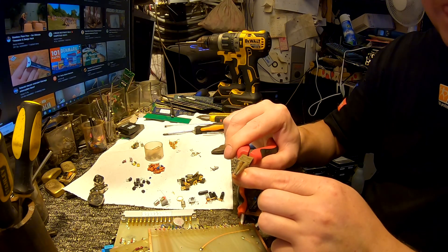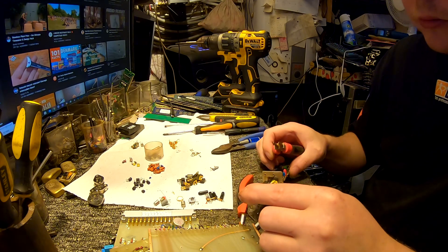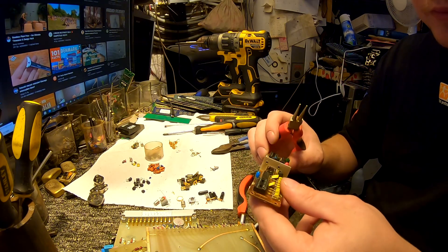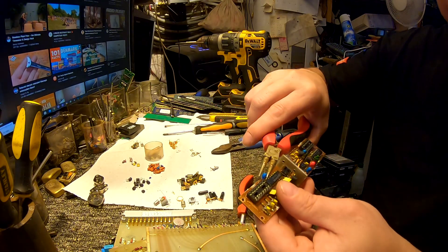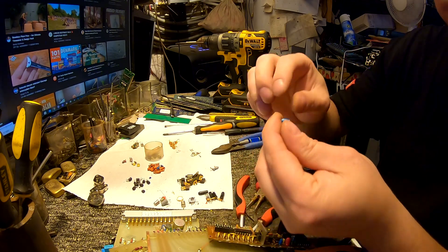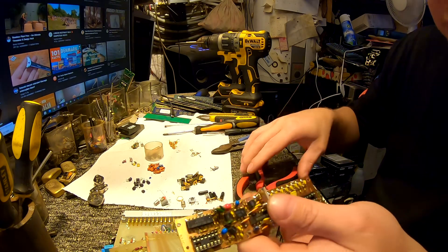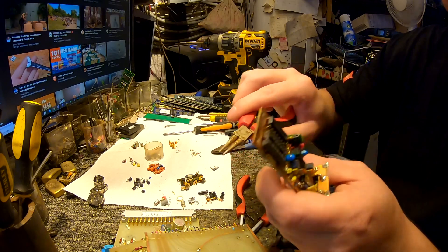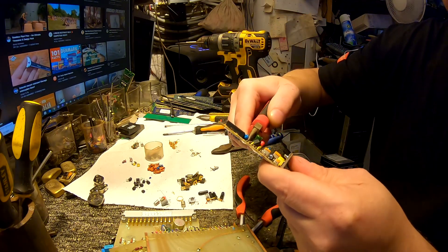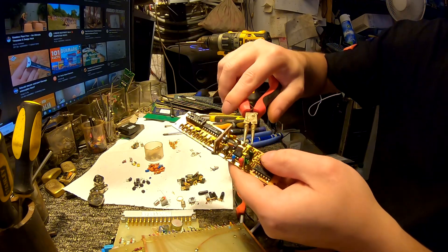Anyway, what I found out is that the round shape allows you to grip the element and as you turn it, it doesn't apply instant force — it applies force slowly. That lets you fish out the SMD elements together with their legs that are dipped in the solder, just like so. You grab it, twist it, and boom — it comes out in one piece. One tantalum to the collection! It works well for tiny transistors as well, and the small shape lets you reach hard-to-access points.